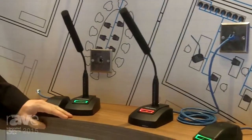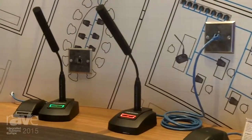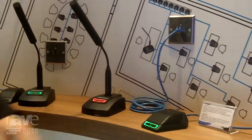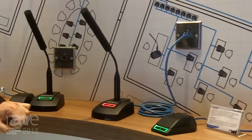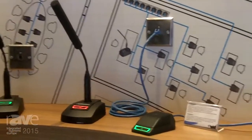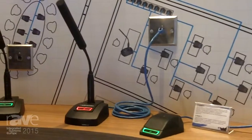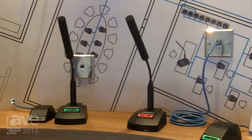What's the benefit of having a Dante microphone, or a Dante output directly on a microphone? The question is whether it's beneficial to go digital directly from the microphone, and the answer is clearly yes. It's not about audio quality or going digital sooner, but for the installer, the integrator, and ultimately the customer, the benefit is that it's easier to scale up and down as you like.